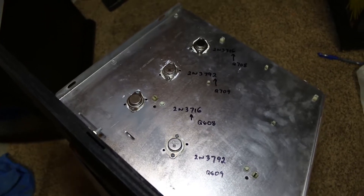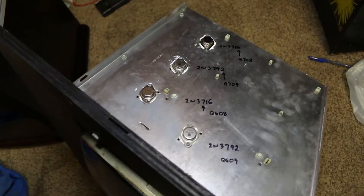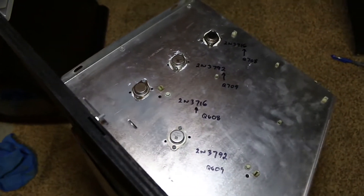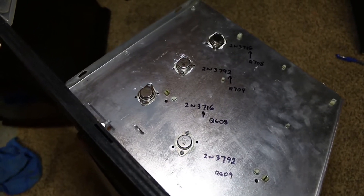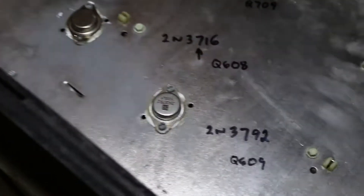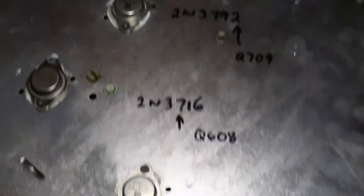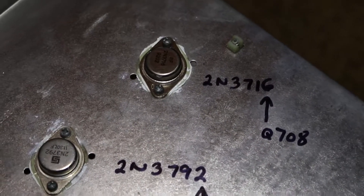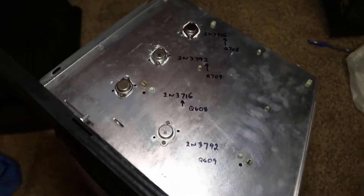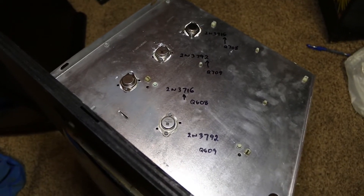I have a love-hate relationship with vector games. I absolutely love them — they are beautiful when they work. But in the entire span of me being in this hobby I have struggled getting them fixed. Let's keep our fingers crossed and see if this will fix the Omega Race. If not, I will have to go back to the drawing board and maybe even do an entire cap kit on the deflection board and the high voltage cage.